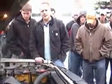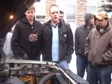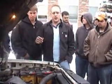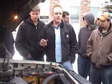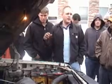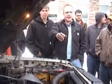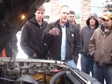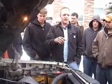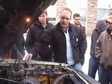One thing that the regulator does, it's actually a bias regulator, so it's set up with 3 ports. It's got a propane in, a propane out, and then it's actually got a port set up for atmospheric pressure. What that does is it allows you variance in the amount of pressure you're putting out. So basically, if that port is just set at atmospheric pressure, that regulator is going to output 25 psi of whatever's flowing through it.